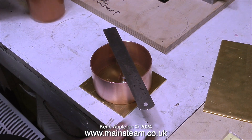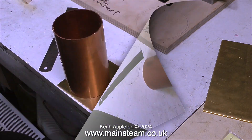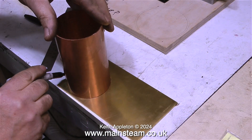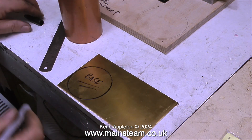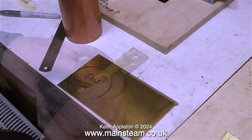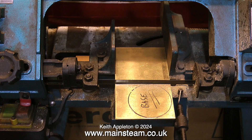When I put my steel ruler on the top of the column you get the general idea of what it's going to look like. The next parts to make are the bases — I'll start off with the tank base. So I know what this is, I'm writing the word 'base' on it. I need to cut this piece of 3mm brass sheet to start with.